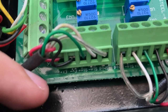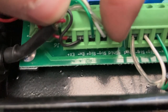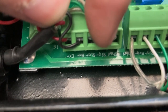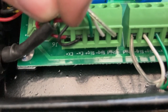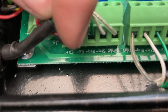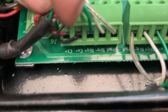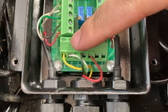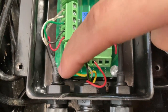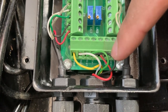Here is a closer look at the markings on the J card itself. The clear port is labeled shield; white is signal negative; green is signal positive; black is excitation negative; and red is excitation positive. Make sure all cables are in the correct order for every connector. Tug on all cables to confirm they are seated securely.